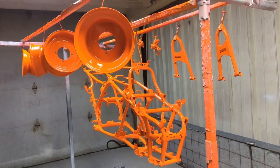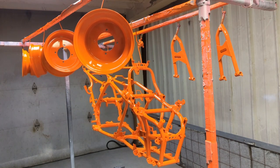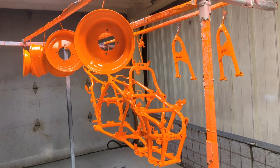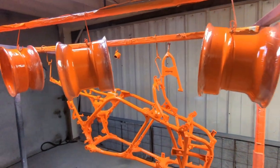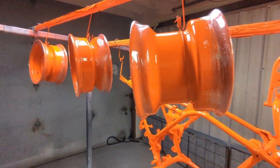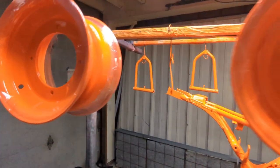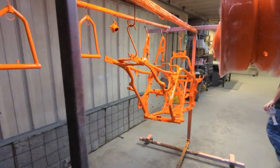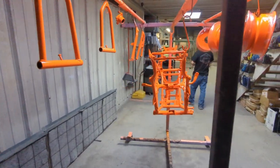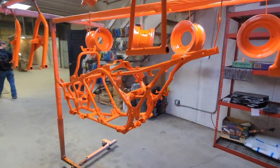Just giving you a little warning — this is a nightmare. See this part dropping? The camera was over here to show you the color change that happens as it cools; you can see it shift to fully cooled and get much brighter. But that part fell off the rack while just hanging and cooling down. It wasn't a big deal — got it stripped and re-coated the next morning, but dropping a hot or freshly cured part is about as bad as it gets in powder coating.